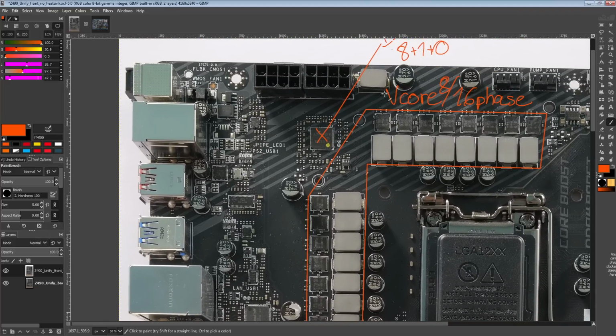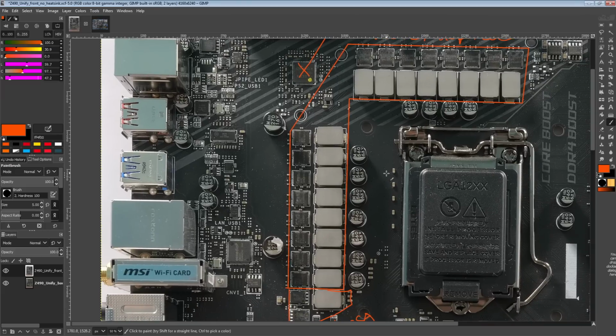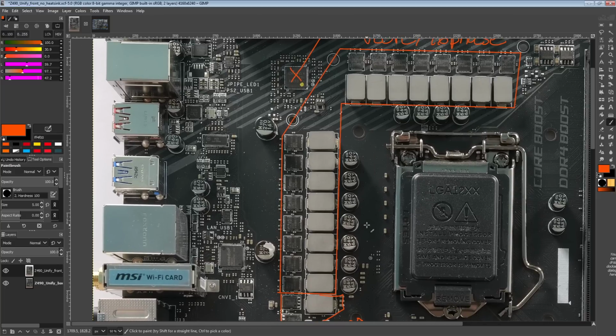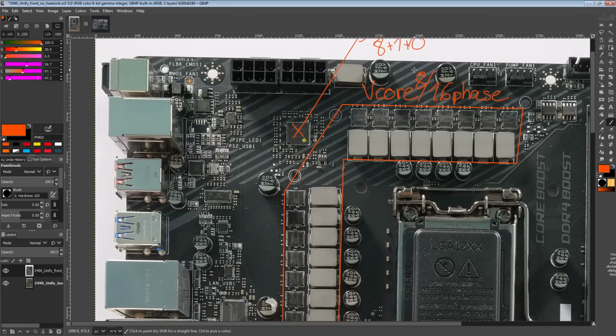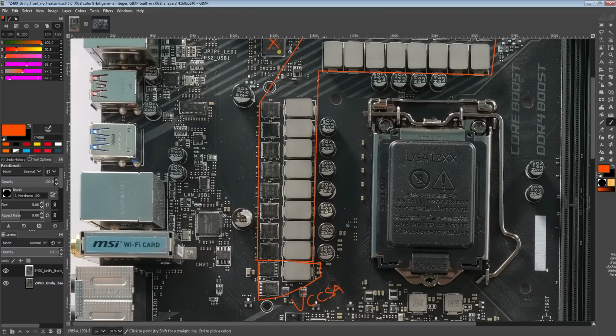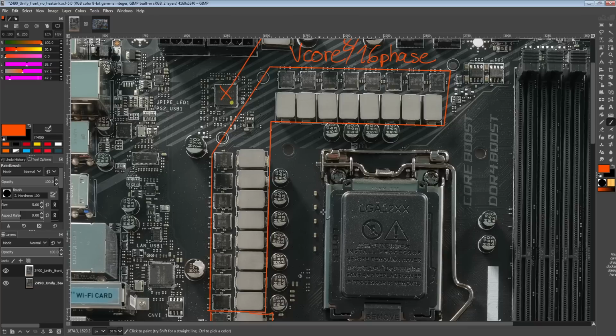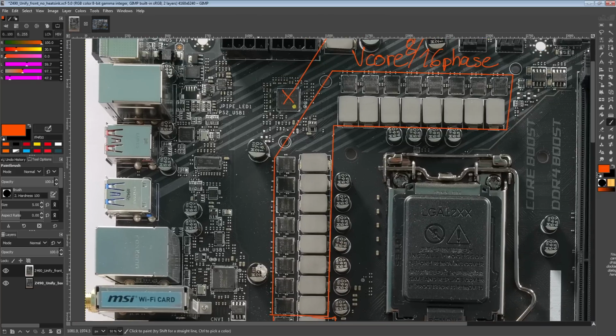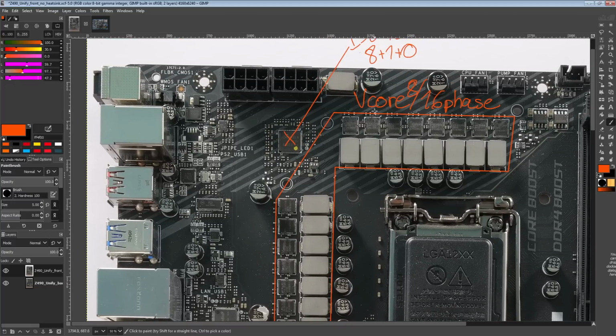If you measure it with an oscilloscope, you'll see big measurable differences, but I've not really noticed it having a major impact on actual output voltage regulation performance. The CPU doesn't care what happens on the 12-volt power plane. The CPU cares about what happens on vCore, and you can have perfectly good vCore even if the input is rather noisy. So it's just kind of interesting that MSI has very few input filtering capacitors, but I don't really think it's causing any issue. I doubt it's gonna make any difference.